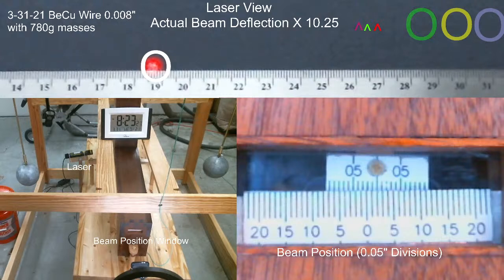Of course, it is doing that. It's made out of wood. We know that. I can tell you that thing has probably changed in size by maybe a 1/16 of an inch in any particular direction. Well, primarily across the grain. Wood doesn't grow or shrink in the direction of the grain particularly, but it will grow and shrink across the grain depending on the moisture content.